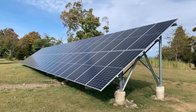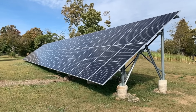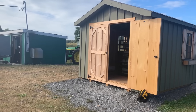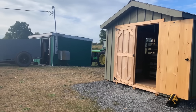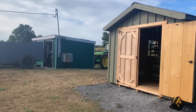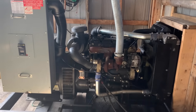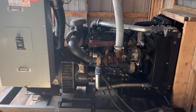What's super cool about this project is it's not only solar — it's got a diesel generator as well as a battery system all working together. This is a 21-kilowatt solar array DC that can output roughly about 18 kilowatts directly into our battery bank. This farm grows sorghum, and behind me is a generator room with a 50-kilowatt generator — two actually, one as a backup. The primary generator for the island is always going to be a great backup to have.